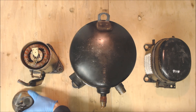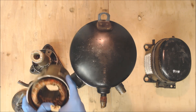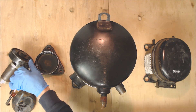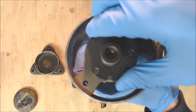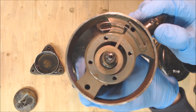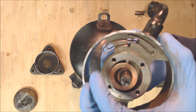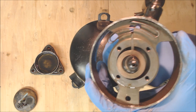Now let's take a look inside. Here's where you have your discharge, and here we have our stator. Here's our rotor. Here's the bottom where our oil is kept, and we're going to take a look at what the rotary compressor looks like right in here. So right here's our suction — I'm going to take this plate off; it had four screws right here. Basically you have your suction coming into a tiny little hole here, and you have your rotor actually spinning and pushing the gas this way, right into a discharge line over here. So it's compressing it and pushing it right forward, then it sucks the suction gas in again and compresses it. So that's your rotary.